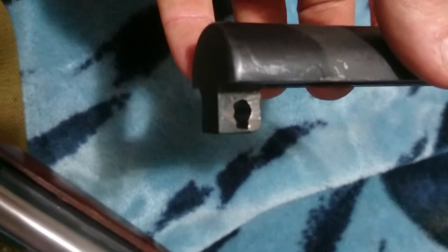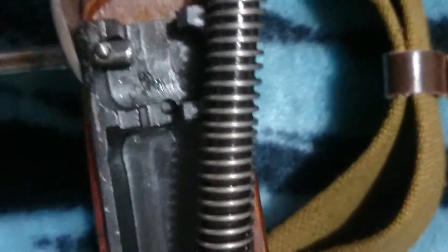I actually had to do a quick modification on the receiver — I had to grind a little notch into it so that the pin can actually pass through and slip in, still long enough to hold the end on. I turned it on my drill press — stuck the bit in the drill press and turned it with a file until it was the right diameter to properly fit nice and snug. It works out really well; it's got a lot of friction because the front pin I used was yet again another drill bit, and that slips in there real nice.